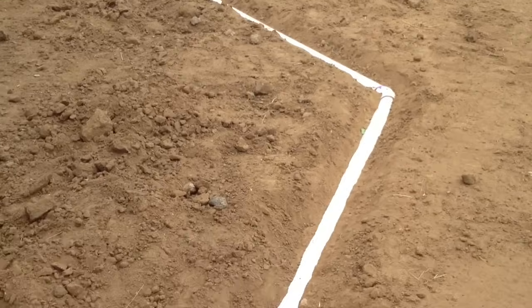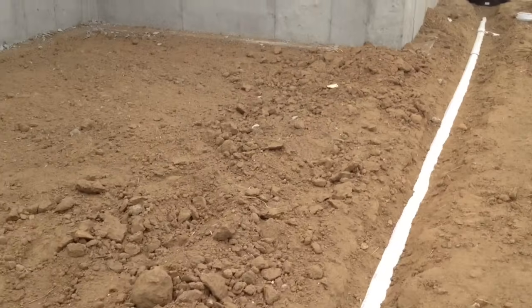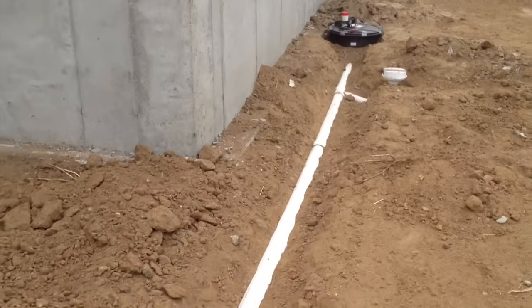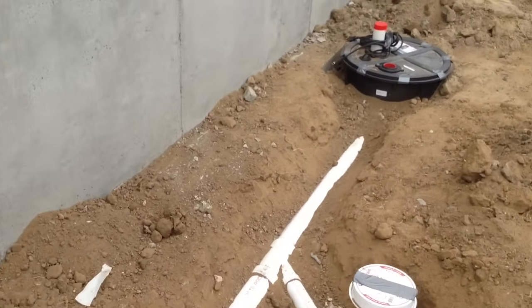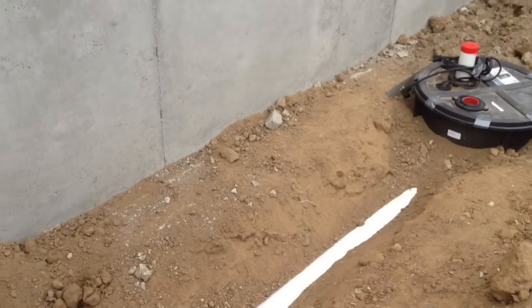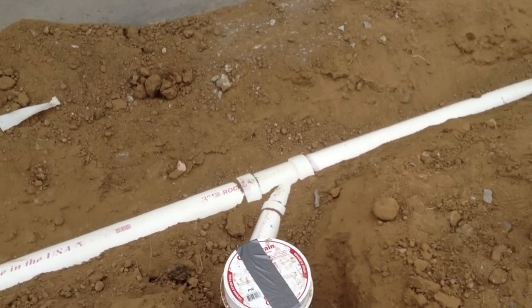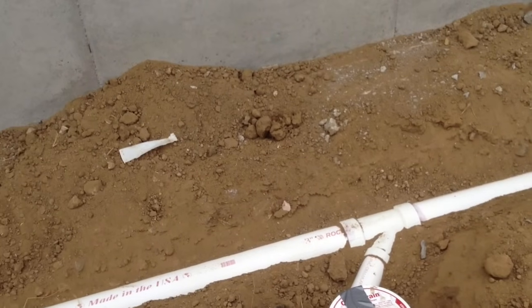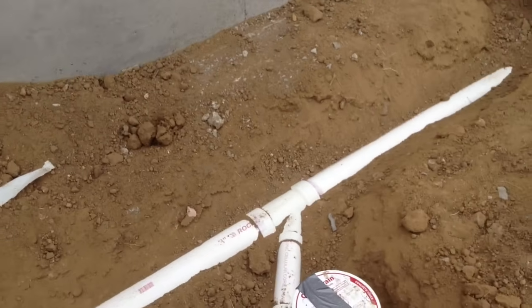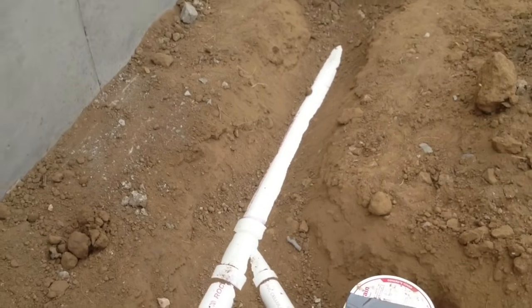This drain goes down — let's follow it down. It's bedded in dirt the whole way; you want to make sure that's firm, so you don't dig down any deeper than you have to. You pack dirt in around it to hold it in place. When this is done, after inspection, the cement workers will put dirt over this and use a jumping jack — a little vibratory compactor — to compact the dirt through here before they pour the cement. We want to make sure it's packed solid underneath, or it's virgin soil, so that it doesn't move on us.